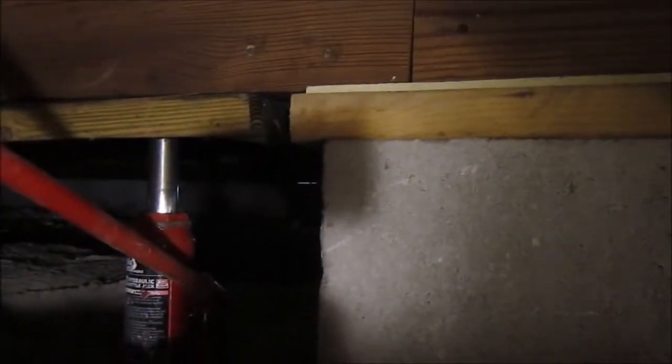And honestly, I think I'm just going to settle for an inch and three quarters instead of 2 inches, and just declare victory. So let me finish jacking this side up over here. That's actually sitting still just a hair high, but once I release the jack, it's going to compress the wood that's on that nib, and flatten it all out so it'll be level.